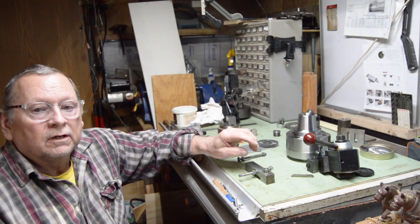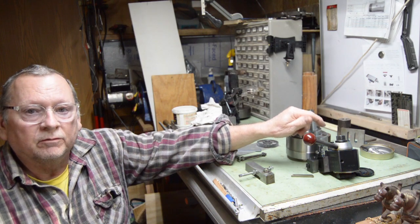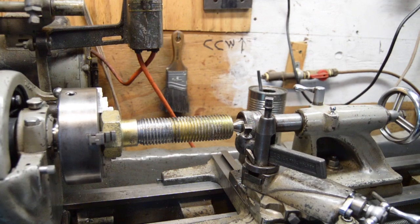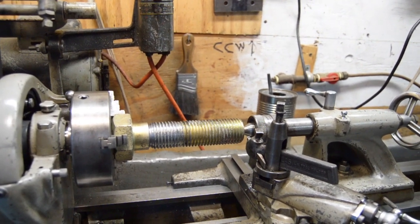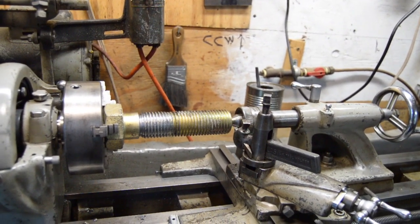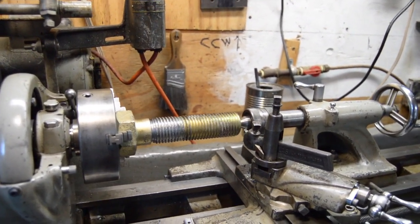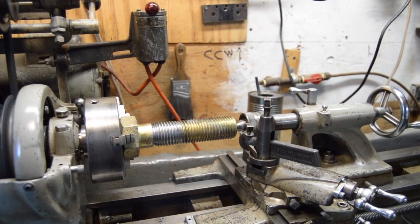I hope you enjoyed this video. I'll give you a little preview of the next one. I had an inch and a half bolt - I thought it was an inch and a half eight, but it was actually an inch and a half six. I put it up today, I cut it - it had a high speed tool in there - but it's a grade eight and it ate the high speed right up. So I put a carbide in there, picked it up again, and ran a couple passes with carbide. Then I went back to high speed steel because my carbide insert is only good for so much depth and the thread was actually too deep. The footage is already shot, I just need to edit it, and that'll be my next video. I thank you all for watching and I'll see you on the next one.